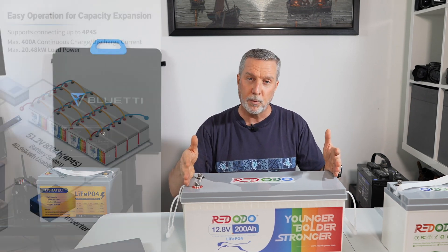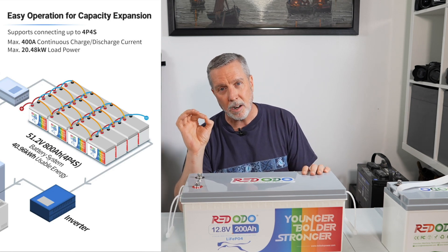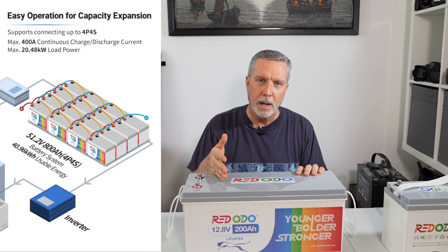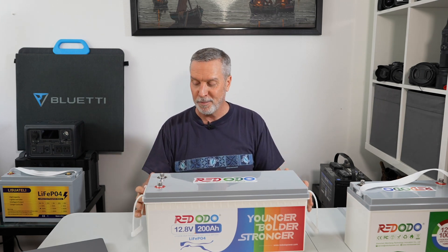You can put these batteries in 4S or 4P configurations — four in series or four in parallel. Four in parallel gives you an 800 amp hour, 12-volt (or rather around 13-volt) battery system. I don't need 800 amp hours in my 35-foot sailboat — the 200 has done me fine. When I'm done testing this, it's going to get added to my boat in parallel to make a 400 amp hour battery. I could essentially run everything full blast because I'll have more than enough battery capacity.